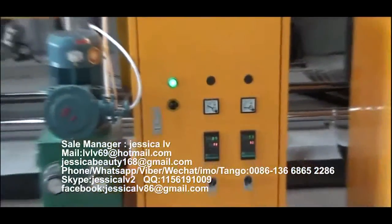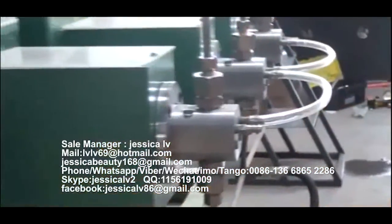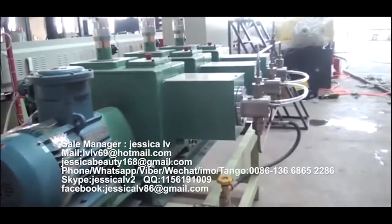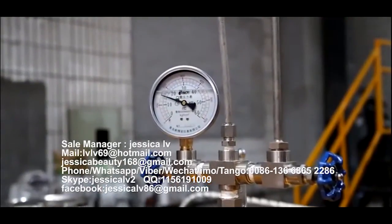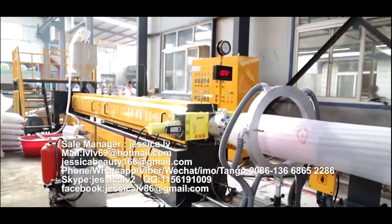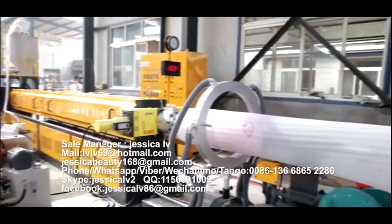The anti-shrinking agent is injected into the spiral tube by GMS pump, to mix with the raw materials. The function is to prevent the product from shrinking. The liquid butene will be injected into the screw tube through the high-pressure butene pump to foam.